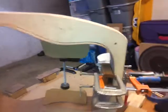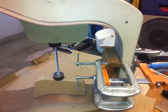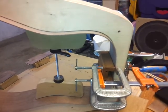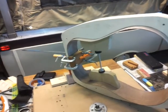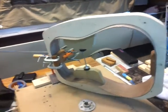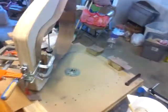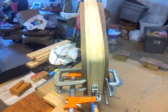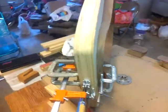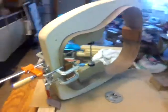I'm used to working with the dovetail necks in the aspect of doing the neck sets. I've done about four neck sets, I think, on my own guitars. They've all come out pretty good. Had to take one back apart. I didn't shim it correctly, and that's the thing. You've got to shim them right to get the heel of the neck to butt against the body really good. And so I am familiar with the dovetails. And one thing you always want to make sure when you're doing this is keep in mind where you are in relation to the top and the back when you're gluing this block, because at first when I was doing some dry runs I had it upside down. That would not be good.